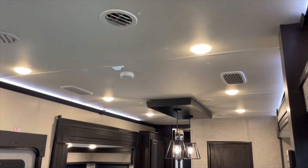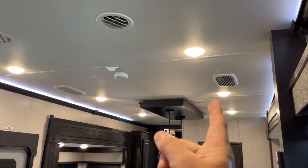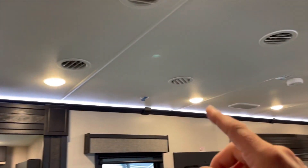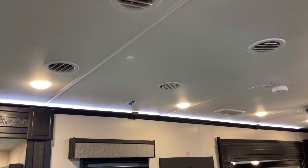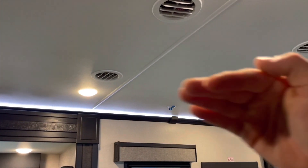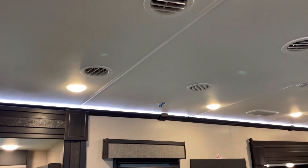It didn't get over 78 even when it was over 100 outside a couple of times — so it's good to get 50 amp, for sure. We also do double trusses on both sides of the AC, and to make it a true racetrack duct system, everywhere there's a stud we have a little insert to keep it perfectly level and flat in there to get the best airflow possible.